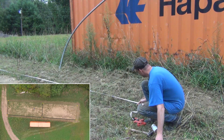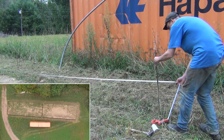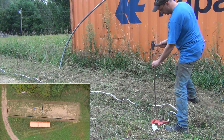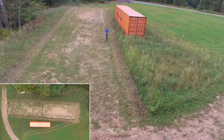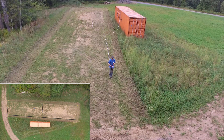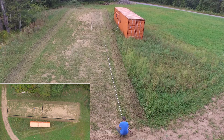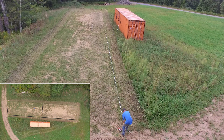From this point, I can now go and measure out the other wall. Basically, go down again to the 72-foot mark, set a pin, and to make sure my width is good, measure across the center to the other mid-marked pin from the 26 feet. Set that post, then go down to the far end another 72 feet, and also check against the 26 feet across the side. And that's all it takes to set up the outline for the building.